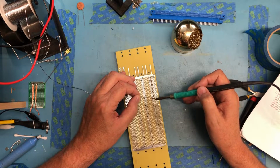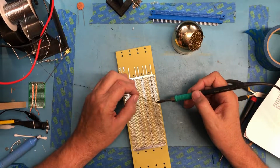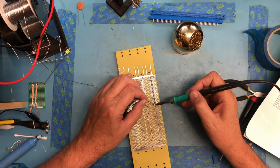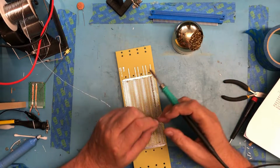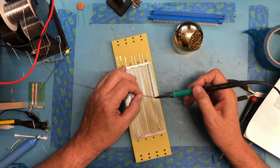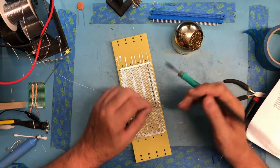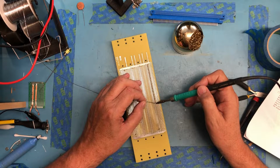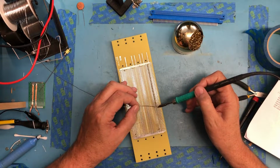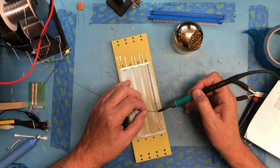You know, the case and the front panel and stuff, of course, I want as accurate as possible. Inside, I want to be able to run higher speed CPUs, Z80s and that kind of stuff. The backplane board I've got, I think people have run up to 10 megahertz on the thing. I typically deal with 8080s at 2 megahertz or Z80s at 4. But it's nice to know you have that kind of speed available. If you look at the boards up at S100s.com, he's got all kinds of processor boards and support boards. You can run DOS and 6800s, and there's just all kinds of options he's got up there, multi-processor support, that kind of stuff. And it would be nice to have a completed machine in a case that could support that kind of stuff.